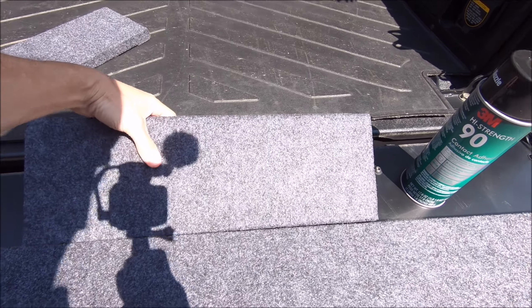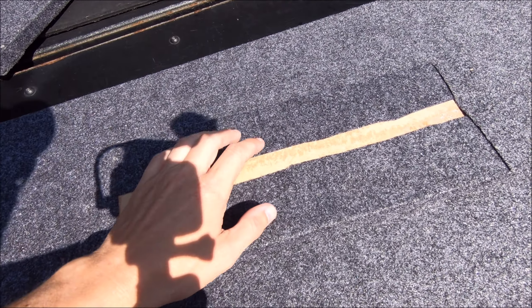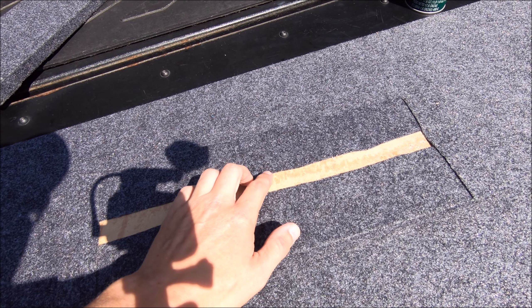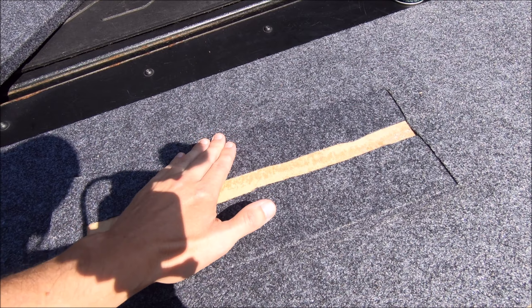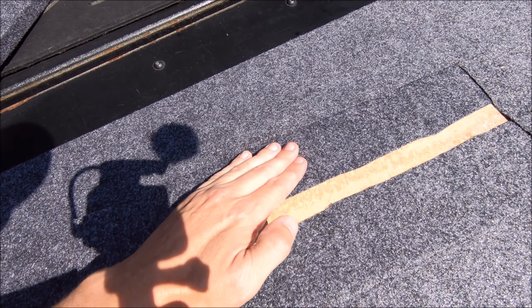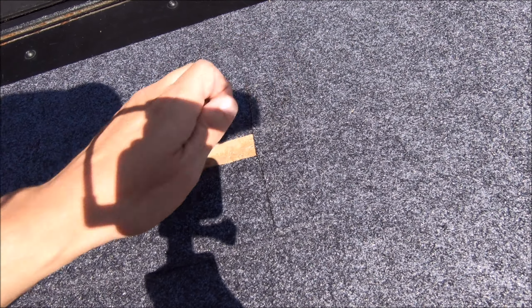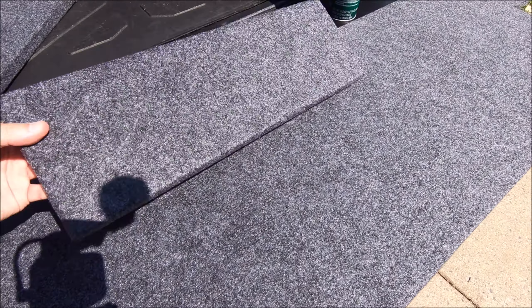Once I cut it — you can see since the back's never going to show, I just left that open. You spray the contact cement on the MDF and then on the back side of the carpet. You don't immediately try to secure it — you want to wait until you can touch it with your fingers so it doesn't try to grab. Then you fold it over and smooth it out away from whatever corner you're working with. You can see I just folded it over on the sides, and that is the result. Nice panels — I think it'll blend in nicely with the back.